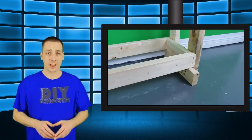This is a tall and narrow stand, so it's very evident that it might tip over and that's definitely a concern you should have. One of the best things you can do is to secure the top of the rack to a wall. If that's not possible, here's an idea I use: I cut some 2x4s to the width of the bottom of the stand plus an extra 6 inches, screw them in place to contact points on the legs, and that will prevent the stand from tipping forward.